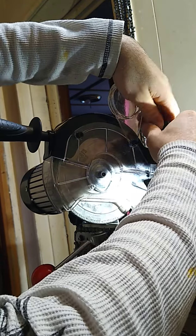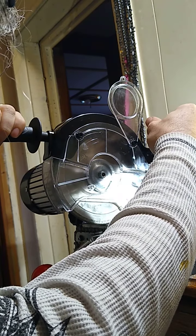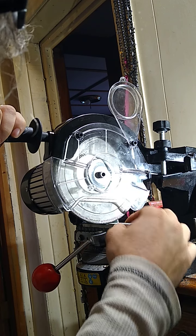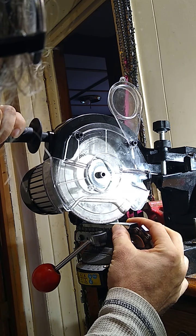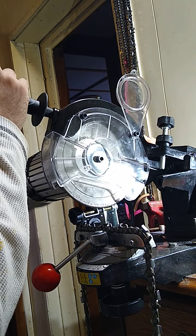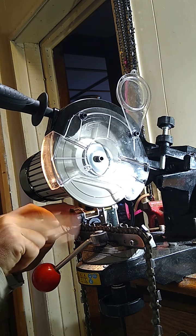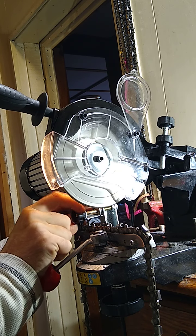It might take a little bit of fussing around. There we go — set that back down. Now the depth gauge is just a little bit loose, but you can tell the wheel is just barely on top. Then you can turn on your machine and start grinding.